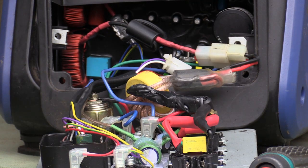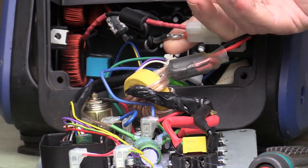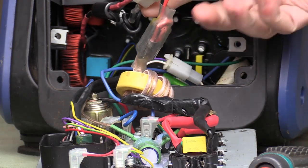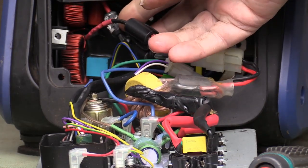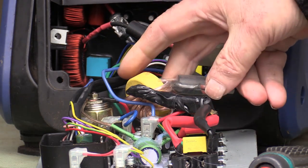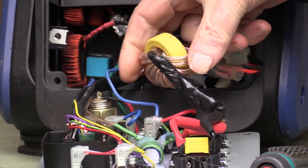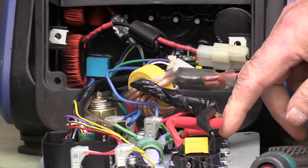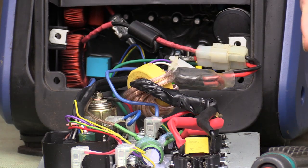On the close-up you can see those ferrites — there's two of them, one on the positive and one on the negative lead. I had to extend the leads. That clear cover is actually shrink-on over the joints. I've also found another one of these little ferrites in the shed, so I'll clip that on before I put this back together. That's the ferrite that came on the unit originally — I've added this one which is a low frequency ferrite, and I've added more on the leads down to the plugs. It has made it better, it is worth the energy, and I hope you have fun with these out in the bush talking on HF.